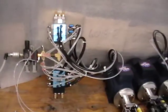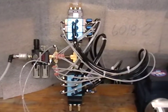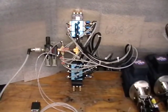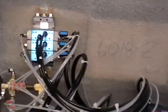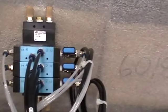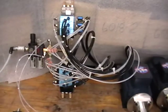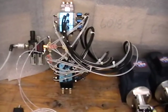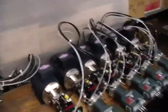We're also supplying the pneumatic control on this, known as a PK 1x6. I actually stack the valves on two separate manifolds. I've incorporated isolation ball valves on the right side of the spool valve or directional valve. This way the customer can isolate any unit he doesn't want to use for drilling and simply shut that unit off.